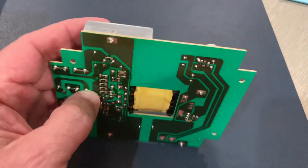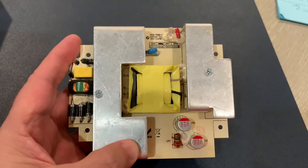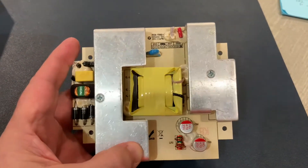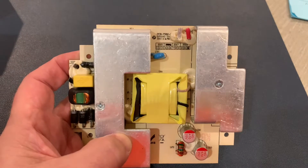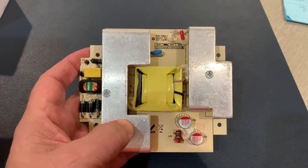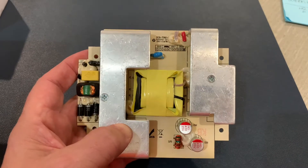Unfortunately, this material has a very high expansion rate compared to a laminate FR4 flame-retardant multi-layer laminate circuit card that's designed to last a little longer. I was in an advanced manufacturing group at Compaq where we did tests on this material, and it was shown to basically have a lifetime of about four to five years after so many thermal cycles.